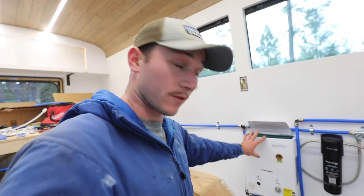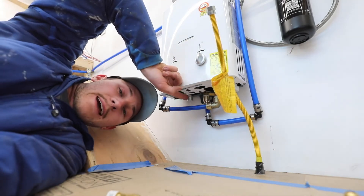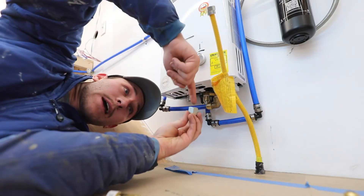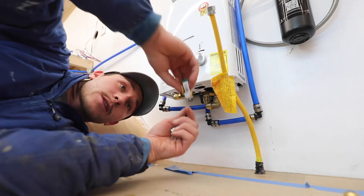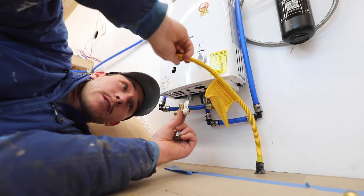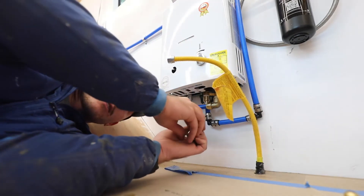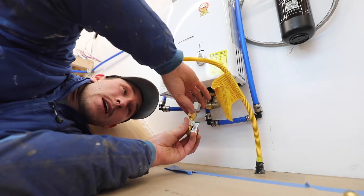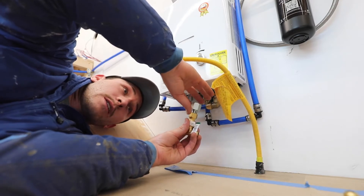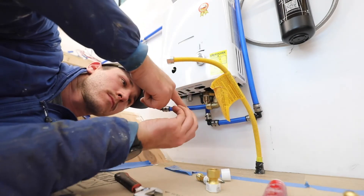Now I'm going to pop some fittings on the bottom of the water tank and then connect the line to those fittings. At the bottom of the tank, this silver outlet is a half-inch pipe fitting, so we need to go from half-inch pipe fitting to three-eighths inch flare fitting. Since I have two accessories that need propane, we're going to put a T in there — one line will go up and some will continue to the stove. To go from male-male on that T we have a female-female piece to go in between. I'm going to build this assembly first and then put it onto the heater, rather than assembling parts while it's stuck to the heater because that could injure the connections inside.